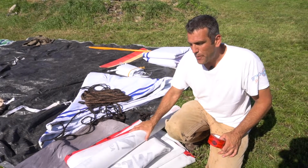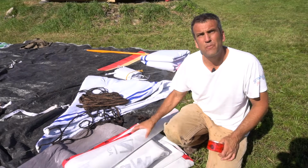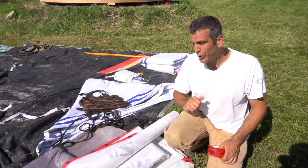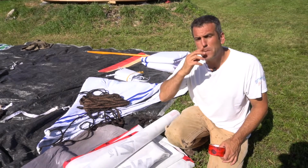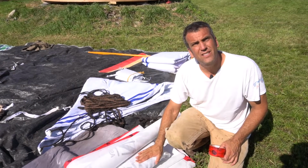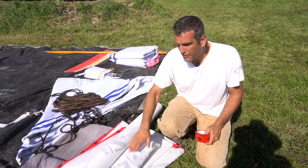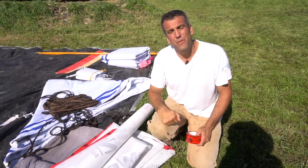The house wrap is an option that we recommend strongly in most climates in North America because they're more humid. The yurt will be covered with a cotton-based canvas that is water resistant but not waterproof. So in case of heavy rains or extended snow melt, you might have humidity that seeps in. The house wrap will take care of this while still allowing the yurt to breathe, which makes it so comfortable and in a way healthier. So the house wrap will stop the water coming in but allow the yurt to breathe from inside out.